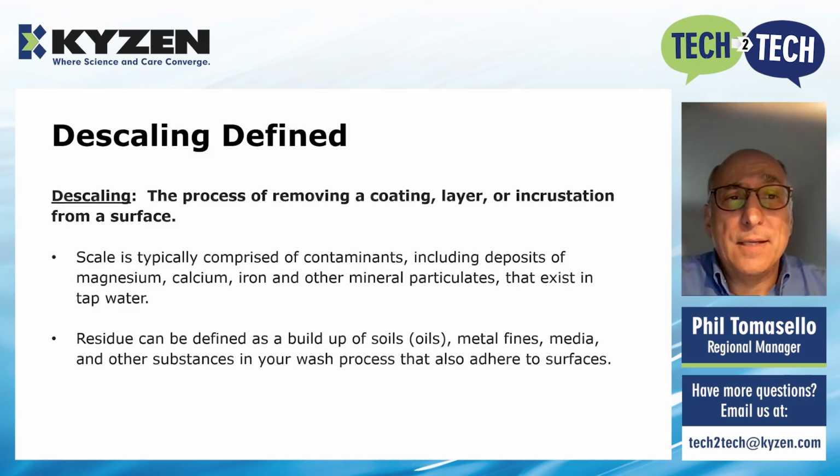If you look at the definition of descaling, it essentially is the process of removing a layer or incrustation or coating from a surface. And scale is typically made up of contaminants, deposits of minerals, of iron, of calcium, of magnesium, other things that occur in tap water or what we would call hard water. In this presentation, we'll talk about residue. For this discussion today, residue is really defined as a buildup of soils, of metal fines, other substances in your wash process that also are going to adhere to your machine.